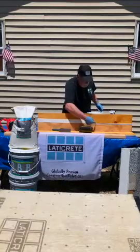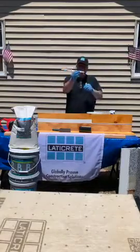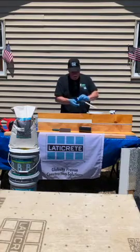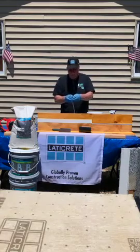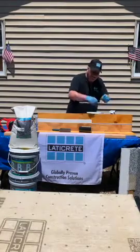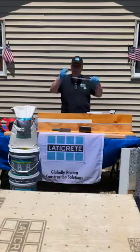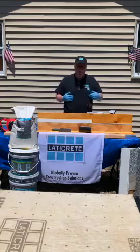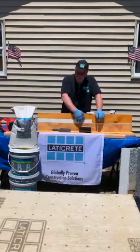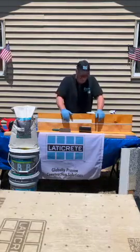What I did here was I put a cove strip up. This is basically a plastic cove strip. It's a 1/8 strip on the back of this. It has a peel off. You can take this adhesive strip off, peel it off, stick your cove up 4 inches high. That'll lock you in at 1/8 underneath of the lip if you want to keep that at 1/8 thick cove base. If you don't have that requirement, you don't have the cove strip, the next best thing would be to put down, I like duct tape, a duct tape strip, just so you can have a nice crisp line there.